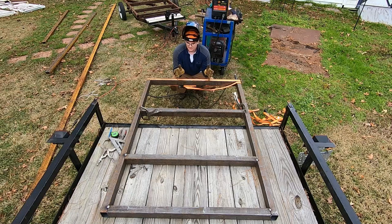On a bigger project like this, where I'm sitting here and I'm moving this around, I don't have any kind of lifting apparatus. It's just me moving it around, slamming it, dropping it, doing whatever. I like to go ahead and do a solid weld, about a half an inch. I still call it a tack weld, but technically it's more than just a tack because it's elongated. It's about a half an inch long. Like I said, I'm moving around. I don't want it to move.